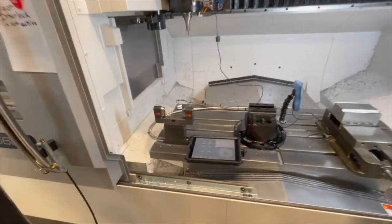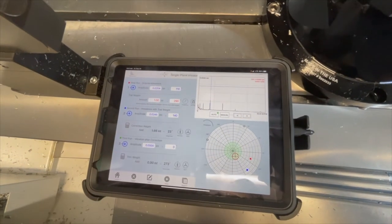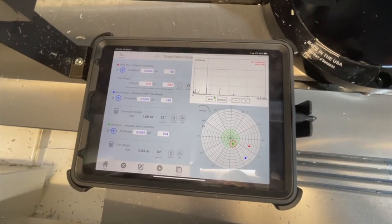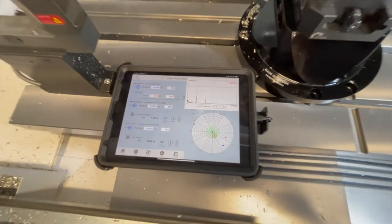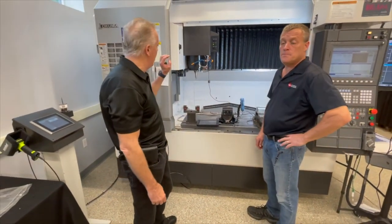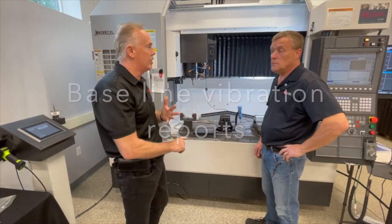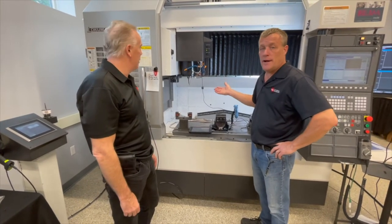Let's do our final run and see how this goes. Wow — good results. We've got the one-times, you can see, is way, way down, and all these other peaks are now coming up. We are at the final result: 0.0063 from a 0.2 to 0.4 to start — that's 10 times better, and that is about 10 times below the lowest specification. We had a very successful balancing of this spindle. Now, if this spindle was installed after repair, it is now trim balanced and vibration analyzed, so we know our bearings are good, we know everything is good, and we know we're perfectly within balance at the high running speed.